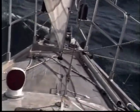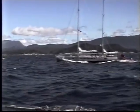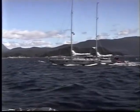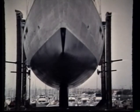Of course, there has to be a kicker. That's when you're plugging to windward, under sail or power. But as you've seen, Sundeer has a remarkably smooth motion upwind. Look at these forward lines in plan view. Since the entire hull length is used to support Sundeer's weight, they can be much finer forward for easy wave penetration, yet provide ample buoyancy downwind. Watch how she reacts to this 3 to 4 foot chop.